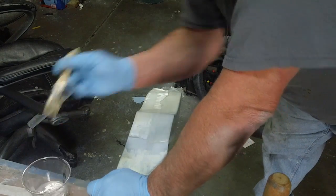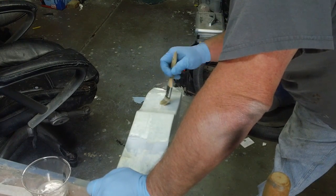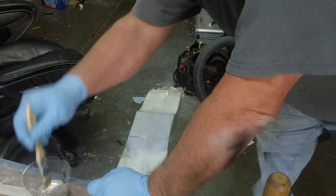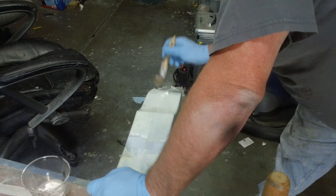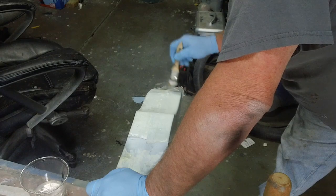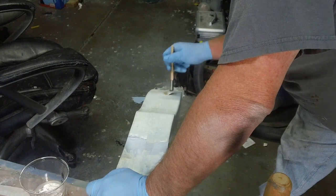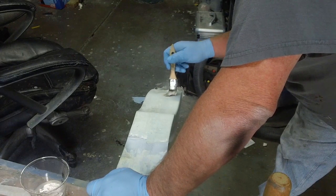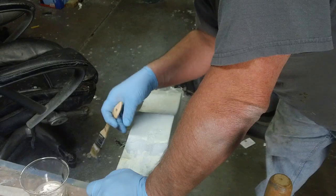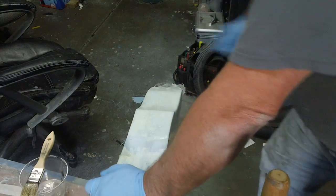What I do is I wait for this to get to its rubbery state in probably three or four hours, maybe a little longer since it's chilly out. Then I come and I got me a template I lay on here so I can cut it in the same place every time. It's one of my old ducts that I cut. I cut it when it's soft but I don't take it off until it's all the way set up, because it's too hard to cut when it's all wet — I mean, cured out. And I get a nice neat cut and it's easy to cut.